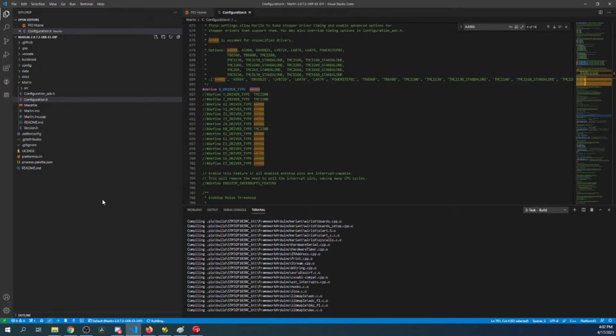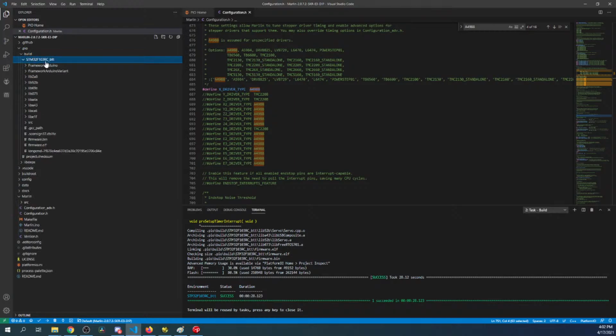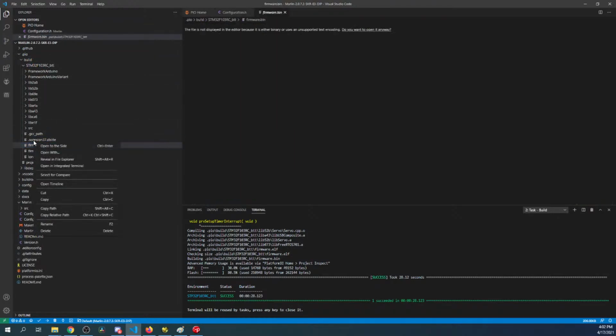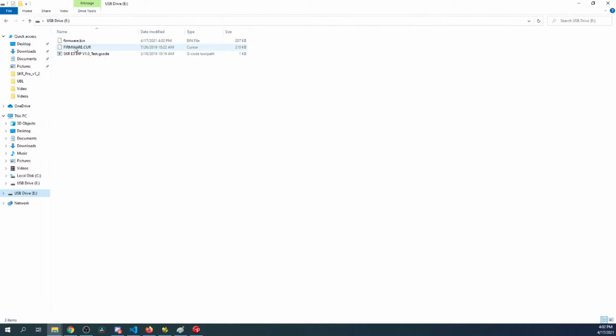So it looks like it's anticipating 256 kilobytes for flash RAM, or EEPROM, which is electrically erasable programmable read-only memory. I forgot what the EE stands for, but it's been a while. Okay, that's done. So let's do as we did before. .pio build, go to the chipset, find the bin, right click, reveal in Explorer, right click again, send to the D drive, double check it. Notice how the other one renamed earlier. So we'll pop that out and go back over to the workbench.